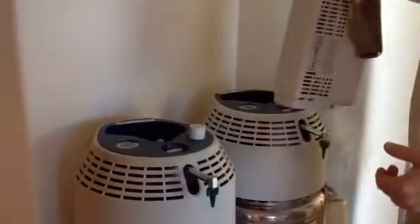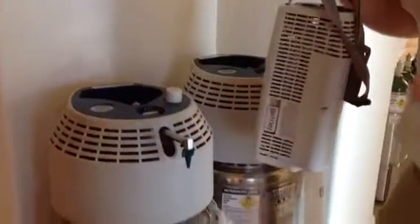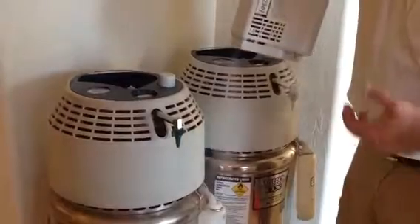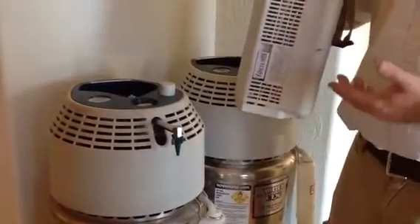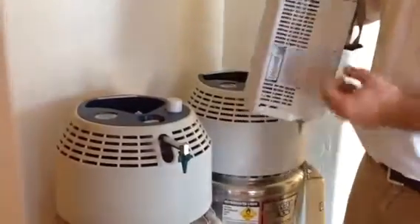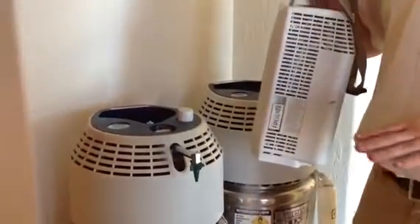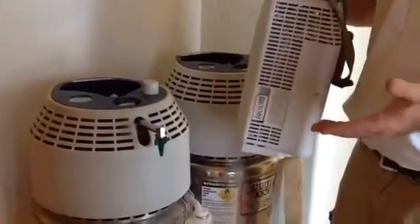This vent valve has now actually froze open, so I'm going to set it down on the surface for 30 seconds to a minute, and it should thaw back out. This is a good indication of a safety thing we want to look out for. Liquid oxygen is itself negative 200 degrees, so it's a very cold substance. If you see actual liquid coming out of it, it's not something you're going to want to feel or play with. Frostbite may occur, so be very careful of any liquid you see.